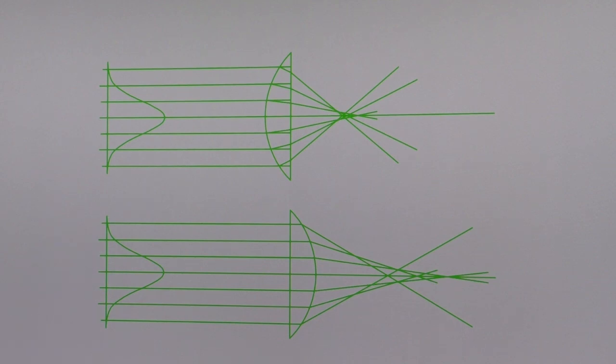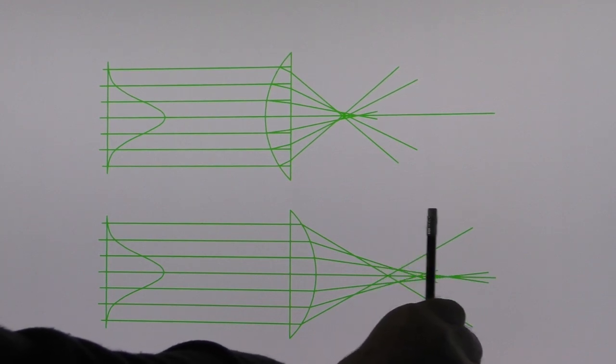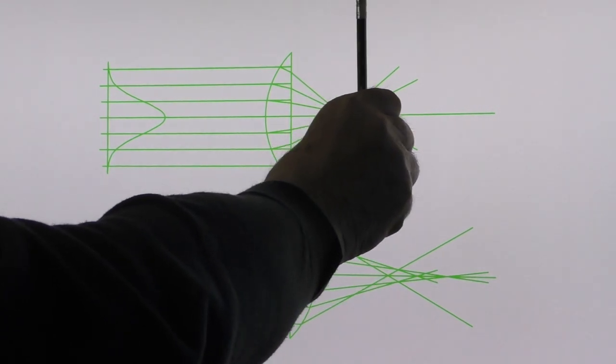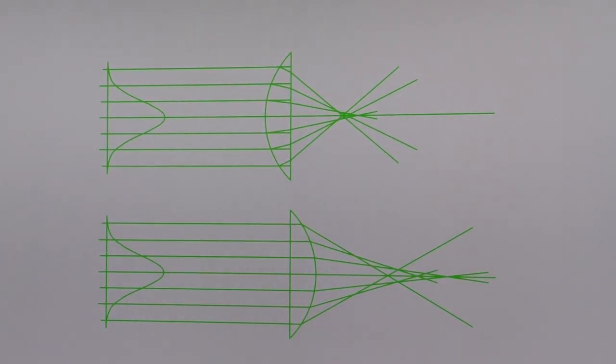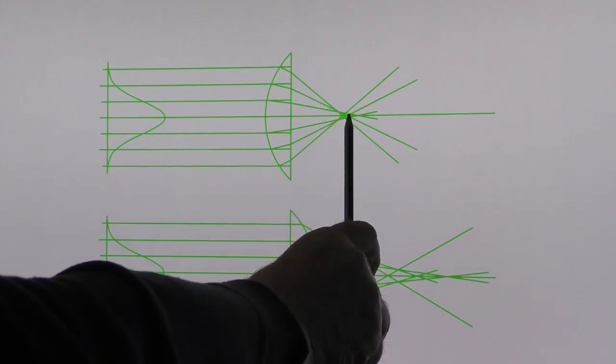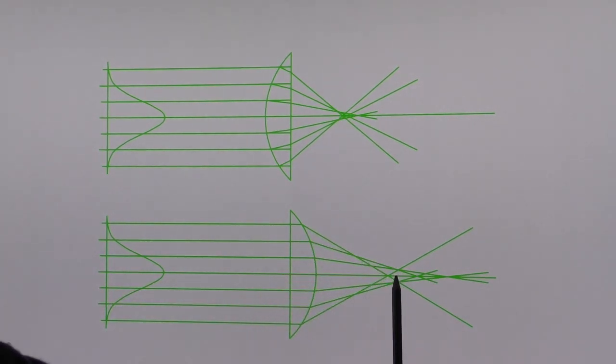And this is what I want to look at today in great detail. We'll probably find that we get a wider range of focal distance as we change speed than what happens with this one. When we change the speed, we'll probably find that we get a narrower focal range. Now, when I say narrower focal range, what I mean is net burning range. You know, the power of the beam is probably between here and here as we change speed. Whereas here, it's going to change from here to here. It's going to be a much wider range of focus, as we call it focus.